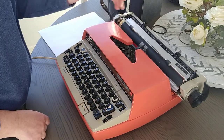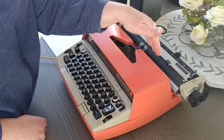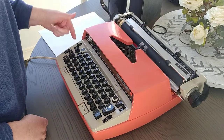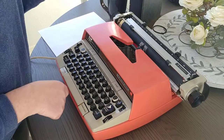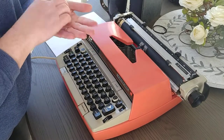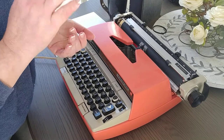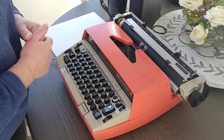You have the ribbon reversal. When you get to the end of your ribbon, sometimes it'll lock up the typewriter — there's nothing wrong with it, it just means you need to change the direction that your ribbon spools are turning. Also if your font gets really faint, that means it's probably at the end of the spool and you need to reverse it. You should be able to use your ribbon a few times.